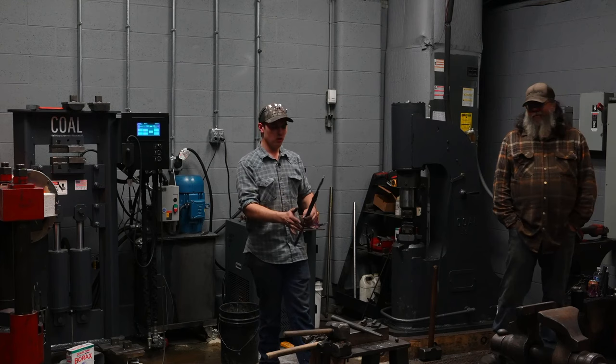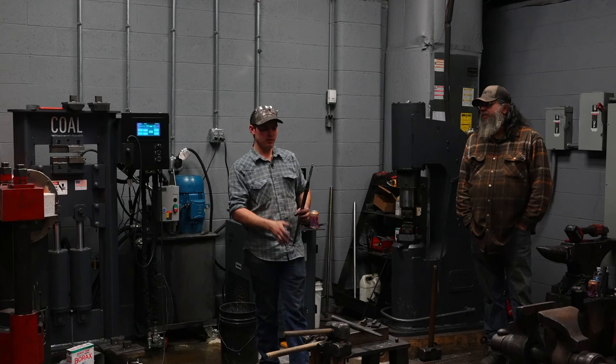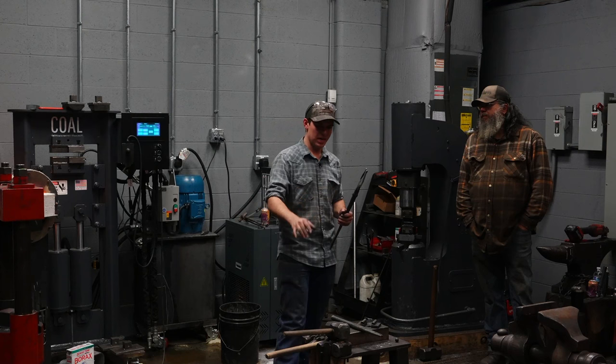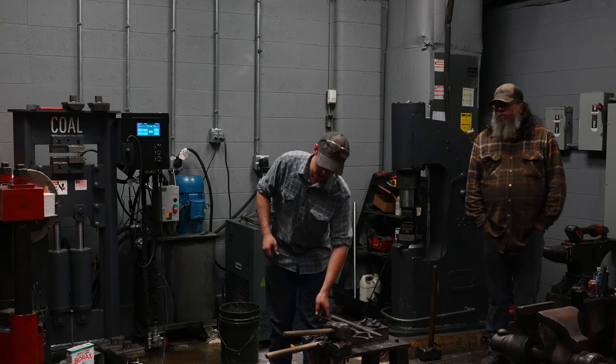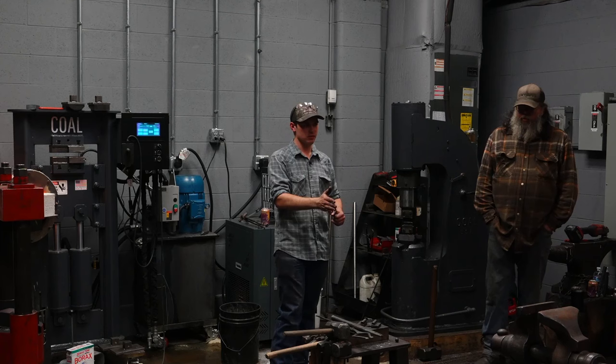When I drifted the hole and I used the fuller on the cheeks, I used a sequence, okay? Center, center, center, high, high. I'm gonna use that same exact sequence. That's the cheeking sequence all throughout the hammer. And then when I flip it to the other side, it's gonna be high, high, center, high, center, high. And that leaves, on each, three hills, three valleys. On each side is four hits, in the center it's six. Is that making sense to everybody?